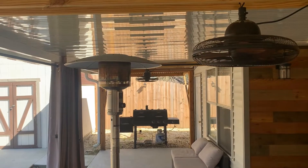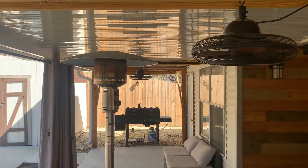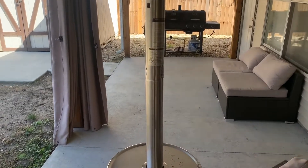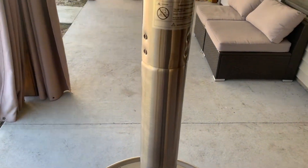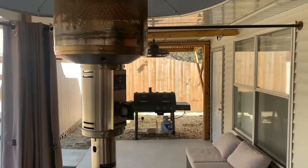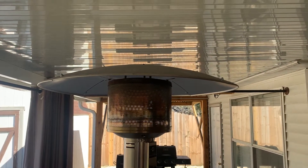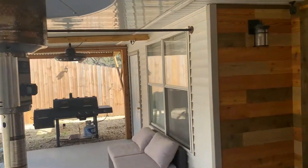I got me a little porch heater — the original one was a little tall and was pretty much touching the patio cover, so I cut it down and re-drilled the holes. I took about 7 inches out of it, and now with it on about medium, it gets to about 130 degrees up there. I think the paint ought to be safe.